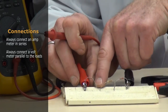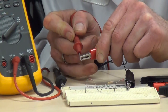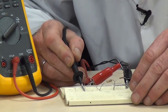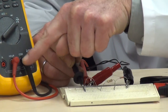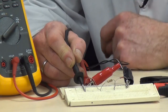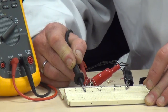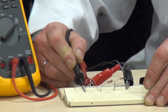We're going to break this circuit and connect one end to the jack going to the meter and then the other end back to the circuit. So how the current is going to flow now is from the power source into the meter, out of the meter, back into the circuit, through the circuit, and back to the source. On the meter we should be reading our current flow, which is 0.023 amps.